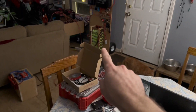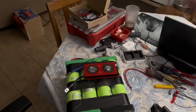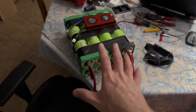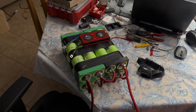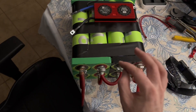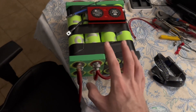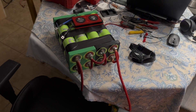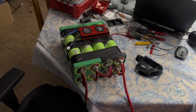My original goal with these cells was to try to connect them to my other little power station over there. But since I lost the nuts it would be kind of a pain. Maybe one day we will — we can always take all this back apart and integrate it. But for right now, we're just going to make this its own battery. I have a spare BMS, so might as well just use it. I'm going to call it quits for tonight. Tomorrow we're going to get the BMS mounted, tape some of this stuff up to make it a little bit more safe, and then charge it. Then we're going to do a discharge test and monitor the temperature of all the posts with a thermal camera to make sure we don't have any hotspots. Because if you have a really crappy connection with a lot of resistance, it'll show up when you start putting a load on it. One day I do want to integrate all my batteries to be able to power everything I want.